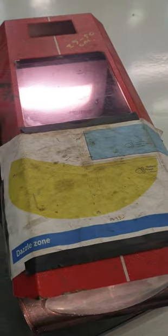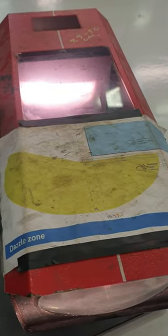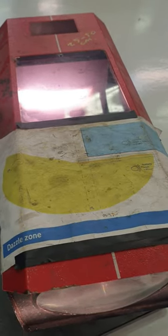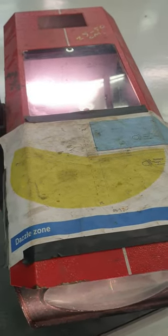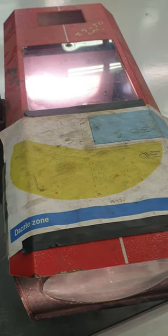Get a 6mm Allen key, place it in, and make the adjustment. I'll show you — this is me bringing it down. You can see it goes way down, but we need to bring it up. Just bring it to just before the 0.5% mark and that'll be perfect.